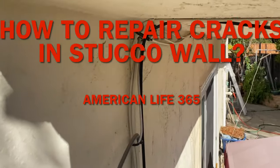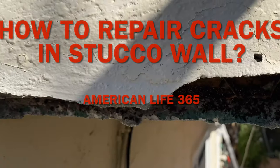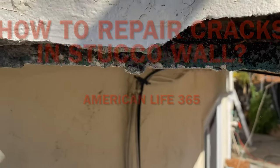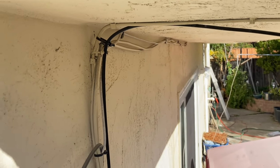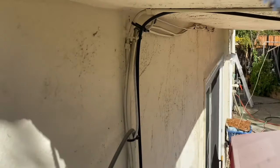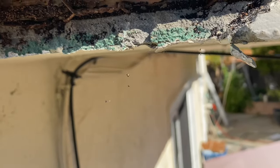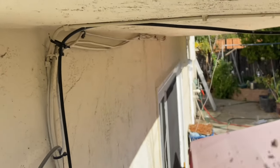The wall is composed of wood studs, steel netting, and stucco. Each wall has different sizes, especially the five-ton chimney. The weight of the wall is different, and the pressure on the foundation is also different. The setting process and the shrinkage and expansion can cause the wall to crack.